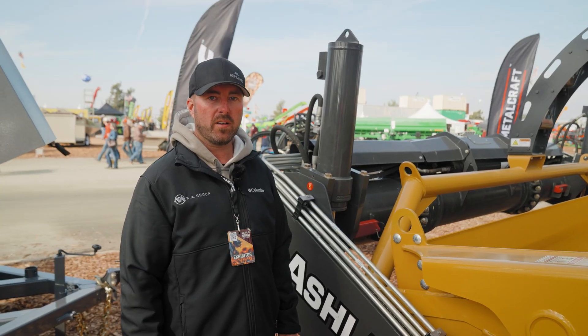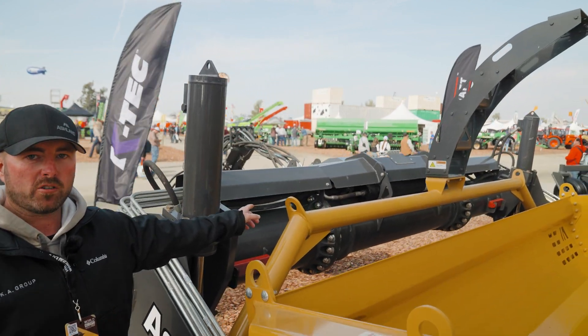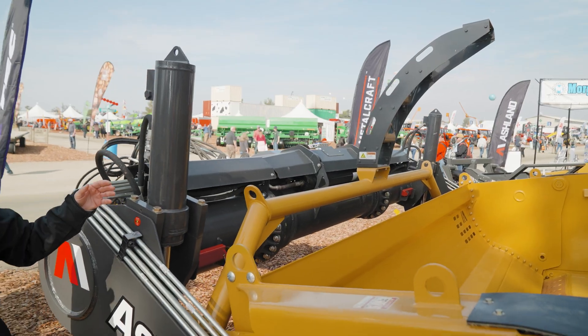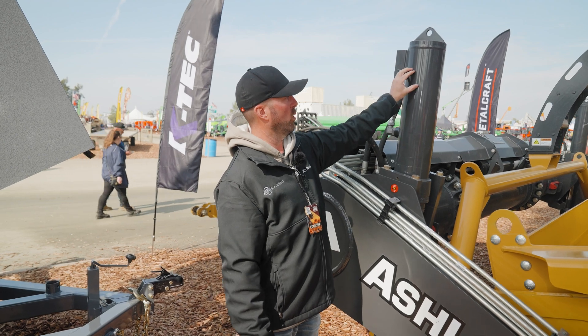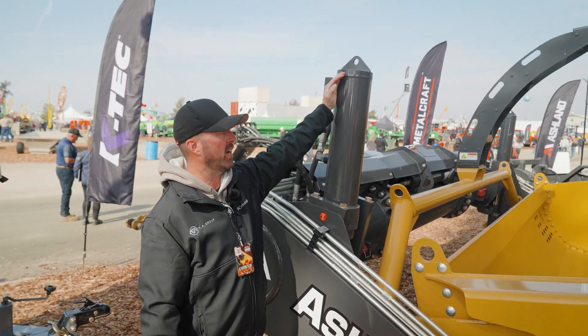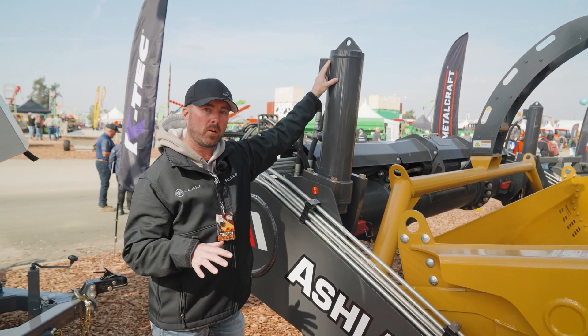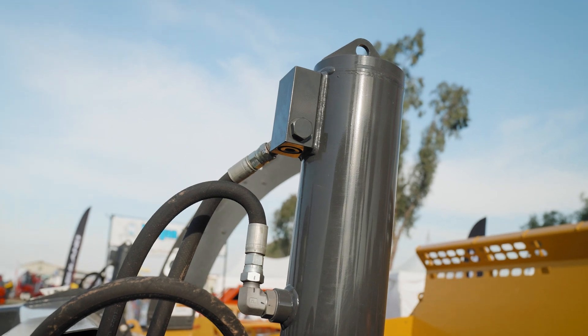Another standard option that we have is our cushion ride. We have a hydraulic accumulator that helps take the shock out of the loaded weight. Another part of our ride control is this block. What this block does is — when you lift the cylinder all the way up, the oil will weep around back to the top of the cylinder, bringing our scraper down to help bring that gland down so we're at the proper ride height.